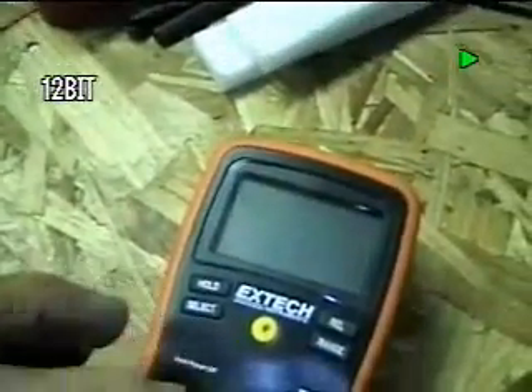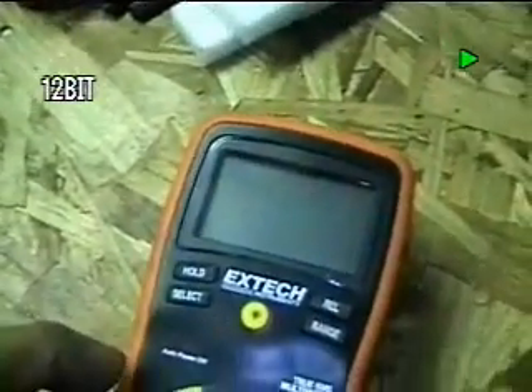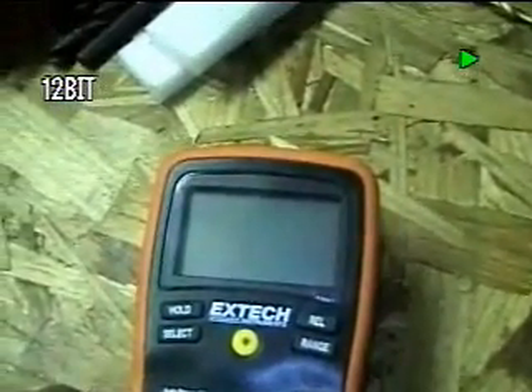Here is a test lead which goes up to the anode right there. You can see it. And this anode is common with all of the other anodes — they're all hooked together in one harness. So they're common anodes and common cathodes. The cathode wire is down here, which you can see connects up to the cathode, and they're all common from underneath. We follow that down and it takes us over here to the meter. With 13 volts in at 10 amps, now we'll turn this on and we'll see the actual voltage with the PWM on.